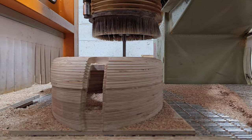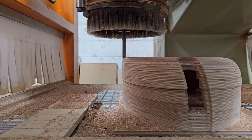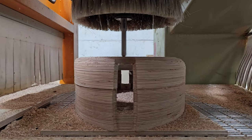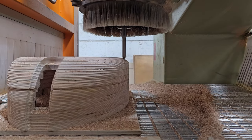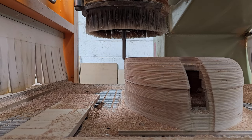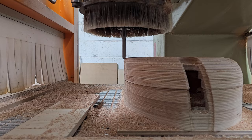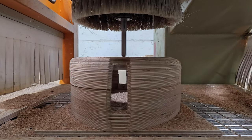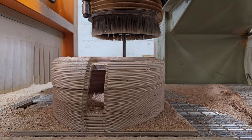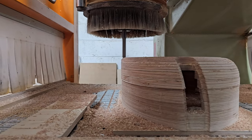I think it's due to these hemispherical cutouts that lead down to these rectangular slots that we can see at the front of the body closest to us. That just gets in the way, and it forces the cutter to mostly work in four quadrants before it finally gets to a bit that it can do a full circumference of. As you can see here, it goes round and gets to a bit and it's like, oh no, I can't do that bit. I need to lift up again.